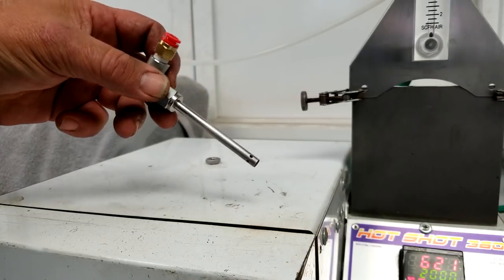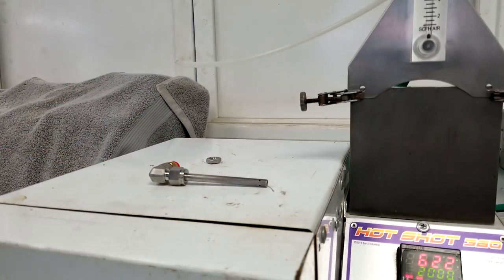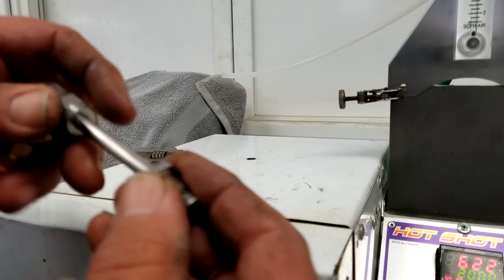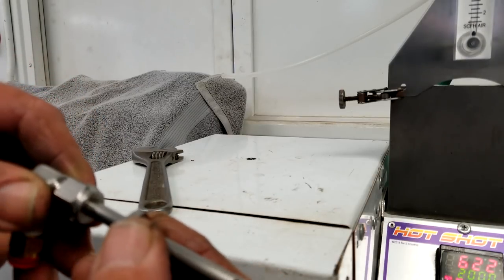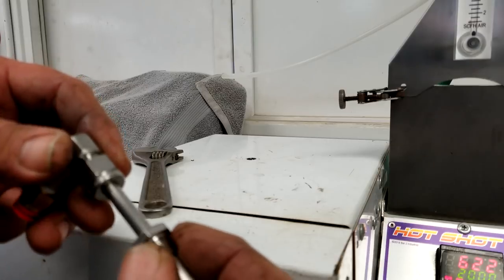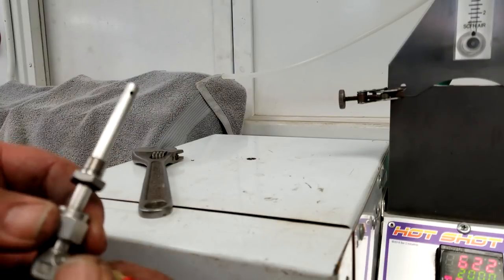The argon tube survived. The o-ring is still intact — even dragging that scaly chalky stuff across it on the way out, it didn't absolutely destroy it. The o-ring might have to be replaced every once in a while but I can include some spares. It's not that hard to change — just dig in there with a scribe point and dig the o-ring out. So giving you spares is no big deal.